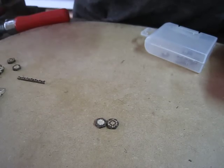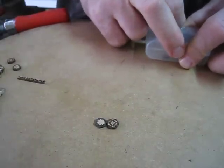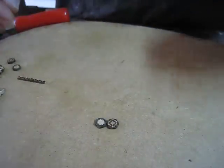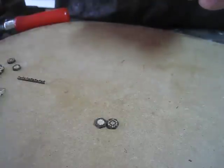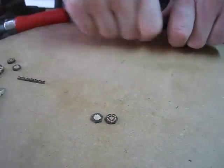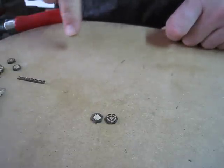These look very hard to make. I've never made one, but I know a few things that make them easier than they look. All of you have mitered purfling before, so if you have, on the end graft, 2 lines of purfling have to meet at right angles. It's very easy to cut that with a chisel. You can get a perfect 45-degree angle by using the chisel as a mirror. That system works with these angles as well. These are 30-degree, 60-degree angles, and you get the same effect. Your eye can see very clearly where to cut to get that angle.